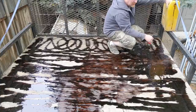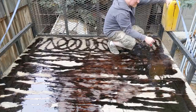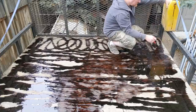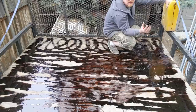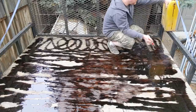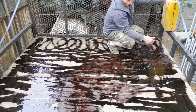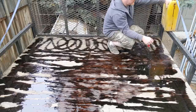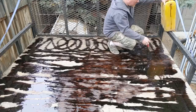Next question I get: is the trailer deck slippery? Well, with wet oil it is, but once it soaks in, absolutely not — it's not slippery at all. You can run on it, jump on it, pull vehicles on it, stuff doesn't slide around. The wood itself — when wood gets wet, the grain expands and actually creates more traction, whether it's a two-by-four or something else. But if your two-by-fours are still green and wet, the oil won't soak in at all, it'll just pool up on top and be slick as can be. Dried out wood — not at all.